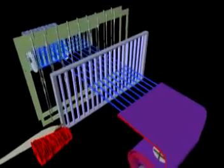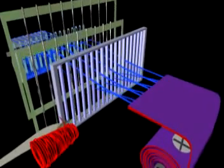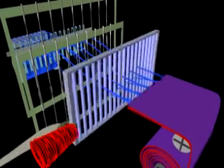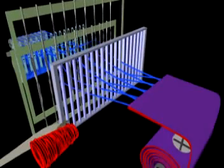The single rigid rapier uses a solid rod material that carries the yarn completely across the warp. This loom footprint requires twice the floor space of the rapier due to the fact that when the rapier is not in the shed, it is housed in a sheath external to the shed.